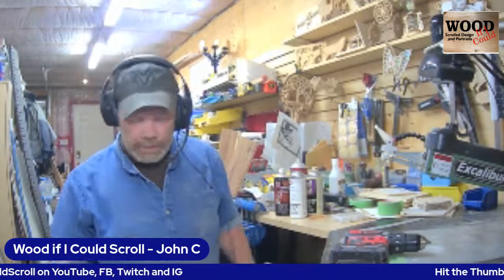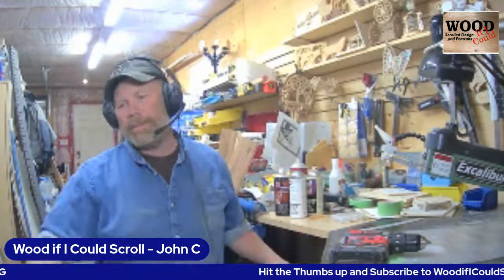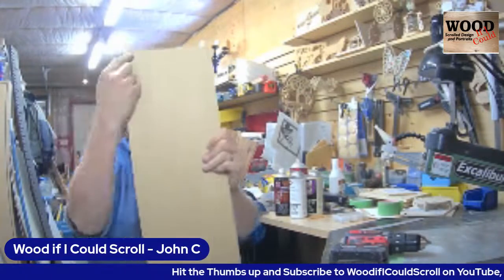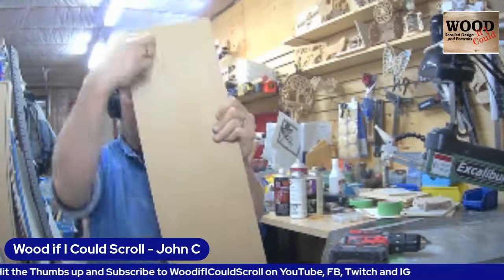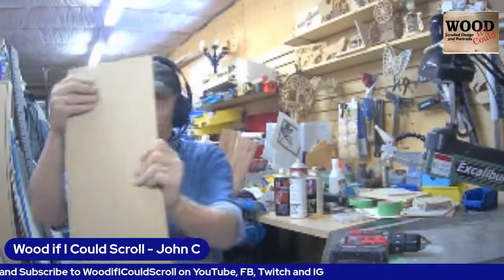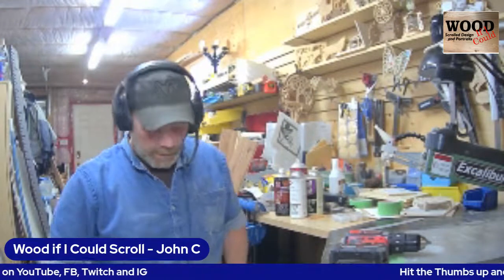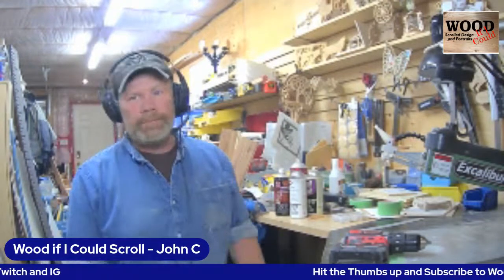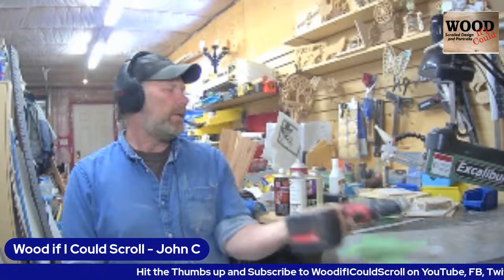So I'm making these out of half inch MDF. So that'll be the front piece there. And then the back piece, I'm going to router. It's going to be 1.5 inches in, 1 inch on either side. Just cut it out, pop it out. And that way it's thick enough for the air intake to work for me. Then since they're MDF, Carrie wants to paint them to match the trim in the house and everything else. So that's what I'm working on today.